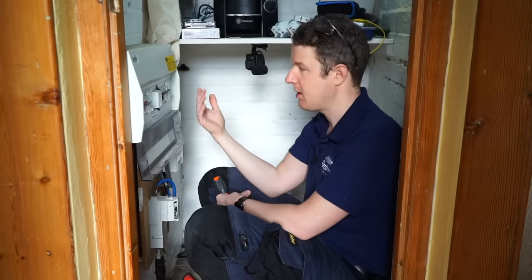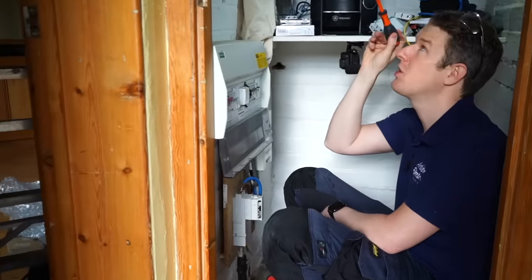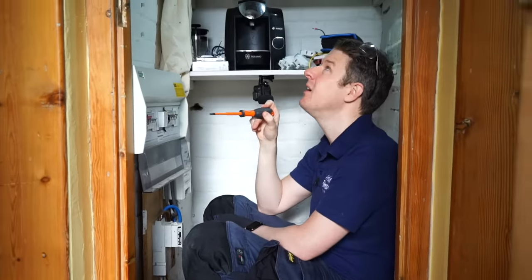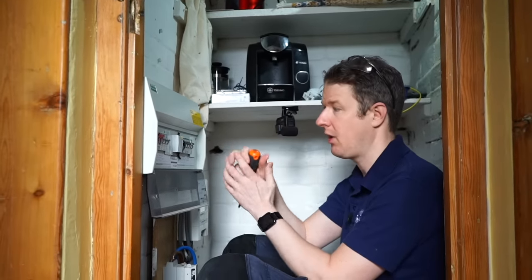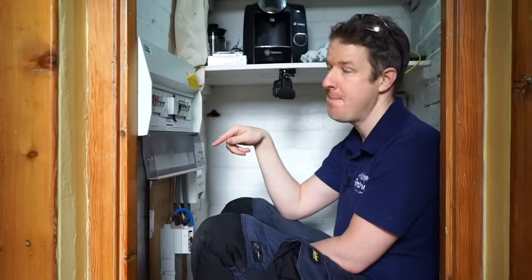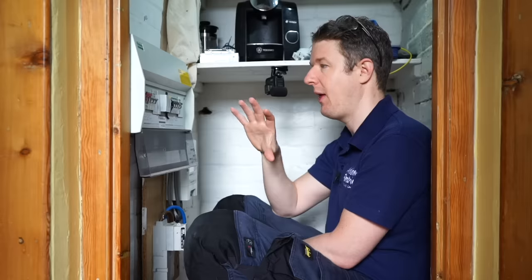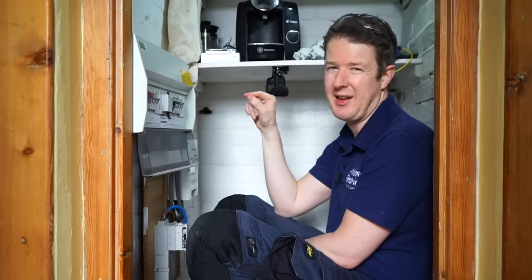The new tenants are actually moving in tomorrow, so I'm going to take this one down now. At the moment all the cables are coming down in trunking — it's a little bit tight, so we're going to replace it with slightly larger 75 by 75 trunking. We're fitting a fancy consumer unit today — the Hager Design 30, which is a little bit more fancy than the Design 10 we usually fit. They're not that much more expensive, look a little bit nicer, and are a nicer build, so I'll be interested to fit that today.